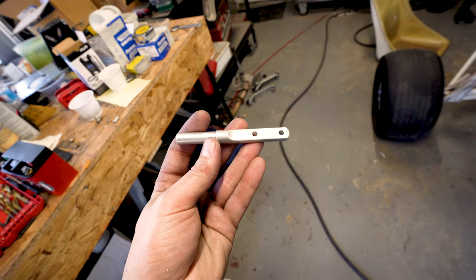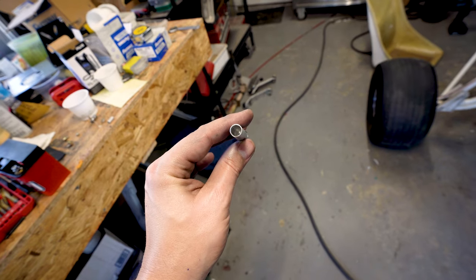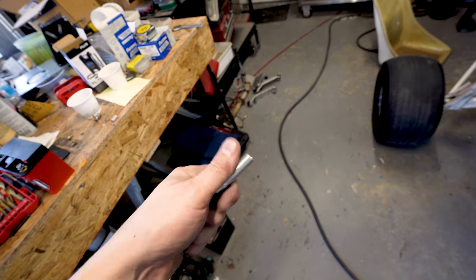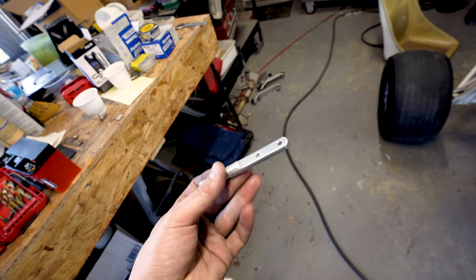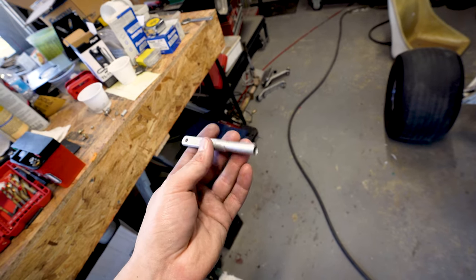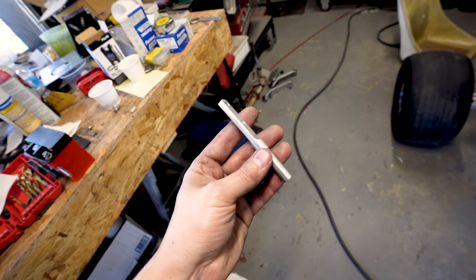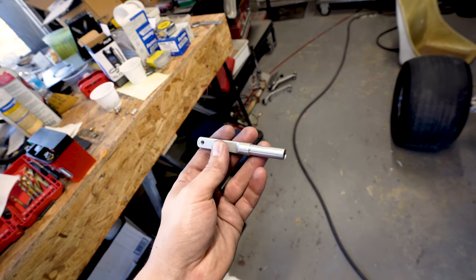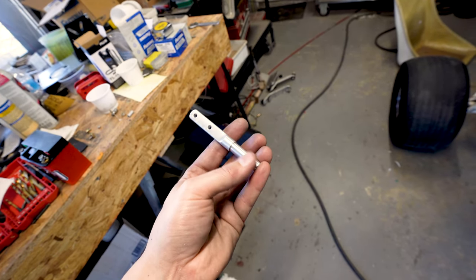And here is our final piece. I've got a drill down the end of it, so it's now going to be riveted. We're going to add some glue in addition to the rivets just for security, to keep it from jiggling around, and also some additional securing on the tube. I added these little quarter rounds here, finished the whole thing, and did the step here.